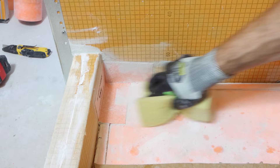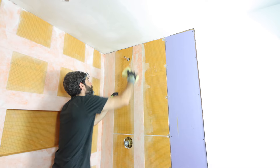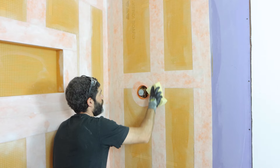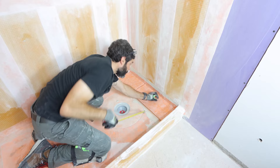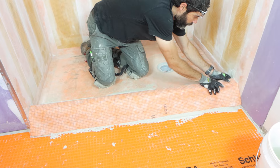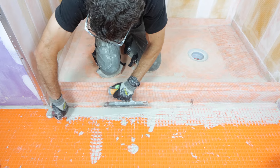If you've got KERDI board, you need to waterproof the seams and the screws using Schluter Allset and the banding. I highly recommend sponging down everything to create a nice smooth surface. I also waterproofed around the valve using a mixing valve seal — this is great for keeping that area waterproof. If you are extending the shower tray, waterproof that using a piece of KERDI membrane. Cut it to size, make sure it overlaps the shower tray and the wall by a minimum of two inches, and bond it to the wall and tray using Schluter Allset, keeping it smooth so it doesn't interfere with your tile work. Do the same thing for the shower curb — use a piece of KERDI membrane to cover any cuts in the curb, whether it's KERDI or KERDI band. Make sure you do that if you customize anything.